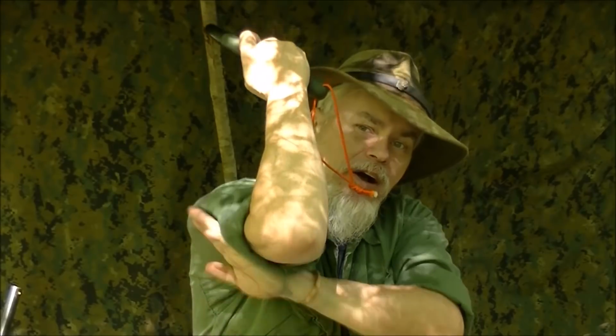That's the reason whenever you're doing push-ups, you know how hard it is to do a push-up versus grab something and pull it to you? Have you noticed that? It's because of two different musculatures, two different jobs. So with the Bahco, if I'm cutting on a push stroke, pushing, coast back, pushing, coast back, how most people think to cut, I'm using the back muscles, the push away muscles, which are not my stronger muscles. And your arm gets tired and you fatigue quicker.